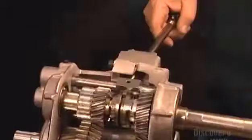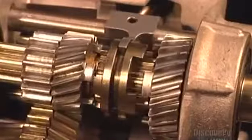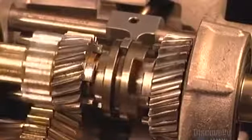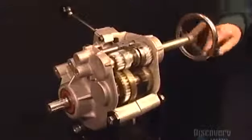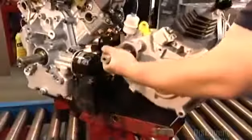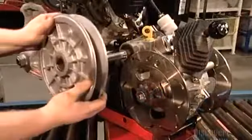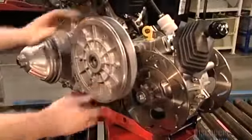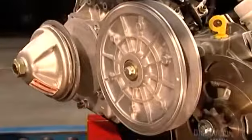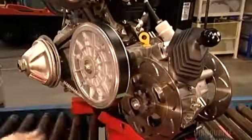Here's how the shift lever changes the gears from neutral to low to high and into reverse. And here's how the clutch will transfer power via a component called the input shaft into the transmission. A worker hooks up the transmission to the engine, then slides two clutches onto the input shaft. He attaches each one with a bolt and two washers, then connects the engine to the transmission with a rubber drive belt encircling the clutches.